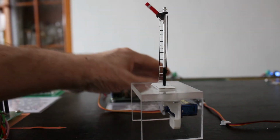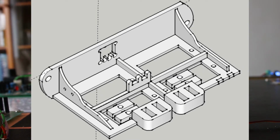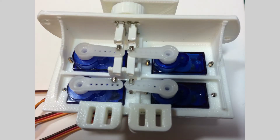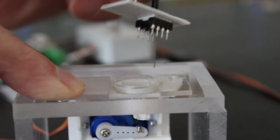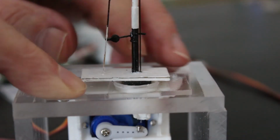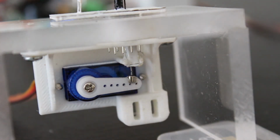Semaphore signal mounts come as a single, kit 684, double, 685, and quad, 686. Each mounts under the baseboard and includes mounting points for the appropriate number of micro switches. There is also a kit to let you unplug your signals, kit 687. This uses 8-way chip holders which can also provide connections for spectacle plate illumination. To make the mechanical connection, a small, powerful magnet such as that in kit 688 is needed.